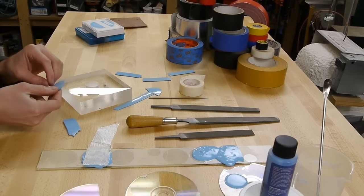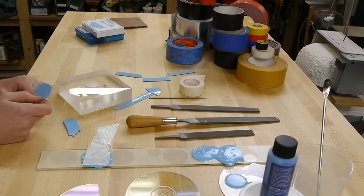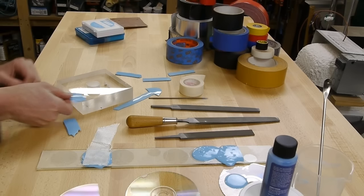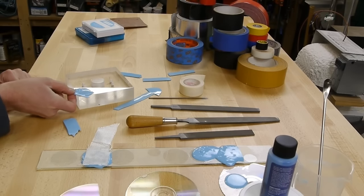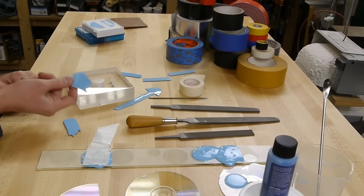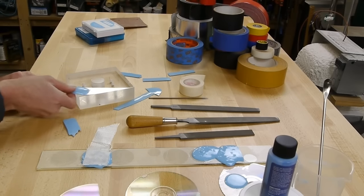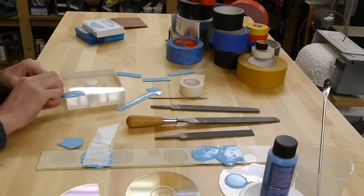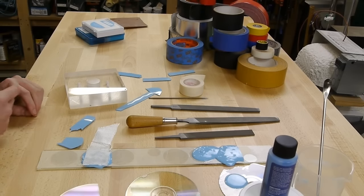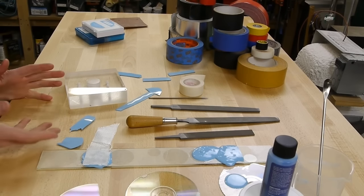This is the silicone I made by casting in the membrane, just like the instructions said. No matter how much I baby it or how careful I am, the friction coefficient with the so-called gecko tape is way, way worse. In fact, this is almost an anti-friction material - it's worse than just flat silicone. It doesn't work. I then found someone's thesis that actually mentioned these instructions and explained why they couldn't possibly work.